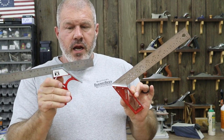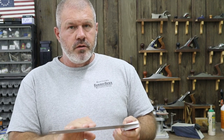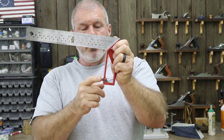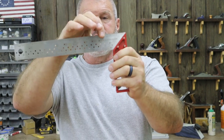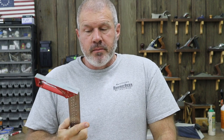These two I'll cover together. Both are K Pro — this is a magnetic lock combination square, and this is a machinist-style edge square. Both have stainless steel blades with engraved graduations that won't wear off. The combination square has a 45-degree face, a 90-degree face, a small ledge you can flip out, holes for scribing lines on quarter-inch increments, and preset degree angles ranging from 10 to 60 degrees. When I got it, I checked it and it was dead-on square. It's more expensive than big-box-store squares, but it's accurate and well worth the money.